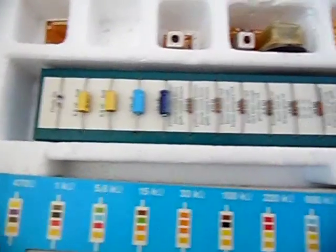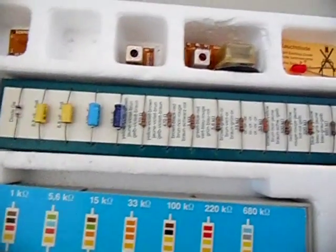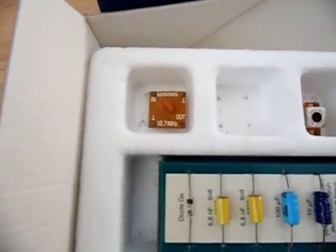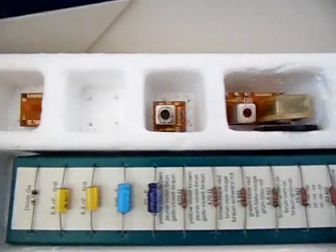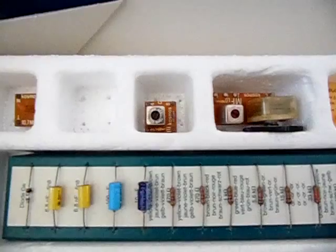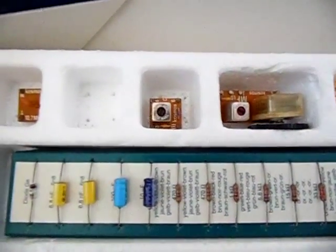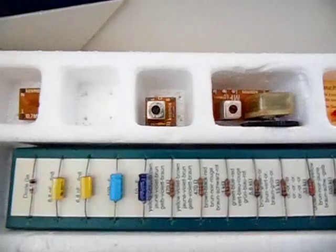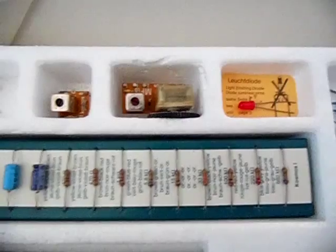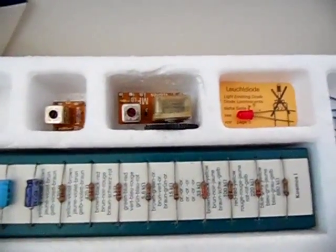This is pretty much the same as what you get with the basic Cosmos series kits. It includes one germanium diode, two 6.8 nanofarad capacitors, three electrolytic capacitors, and some basic resistors. Here we have a 10.7 MHz ceramic filter, and here a coil that can be used for local oscillator or filter applications — it has two windings with a capacitor in parallel on one winding. There's also a variable capacitor with another coil for the local oscillator and antenna tuning circuit.